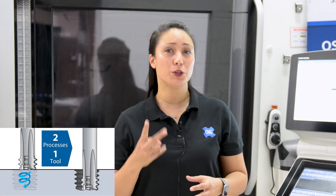The features of the AT2 that allow it to bore into solid materials make it a great replacement for both a drilling and threading process, meaning in situations where you need to combine two processes into one, this tool can provide a great process improvement. Because the geometry of the AT2 is so robust, it is able to cut steels up to 65 Rockwell — and those are the materials that you're going to have the most trouble both drilling and especially threading.